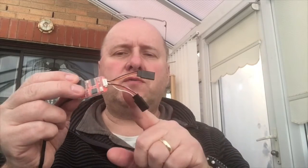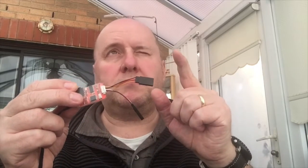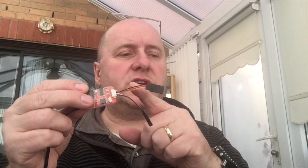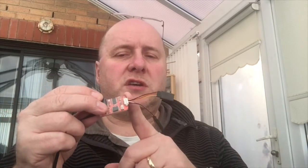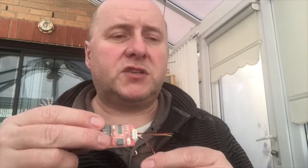If you're using the BEC, the OSD is going to tell you the BEC voltage. What I suggest is you take the voltage input from your main battery instead, so when you see the flight battery voltage on the OSD you know it's the actual battery voltage — not the BEC. Otherwise you'll be reading a constant voltage and you won't know when your battery is getting low.